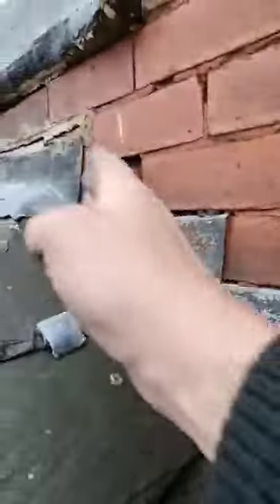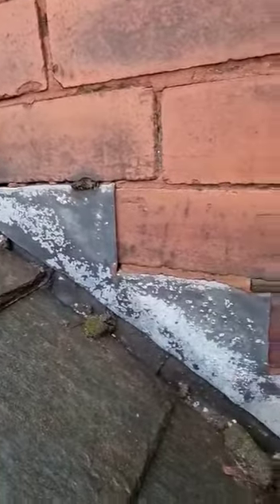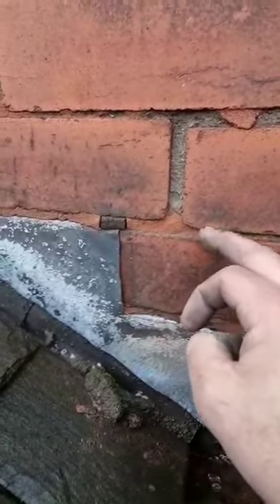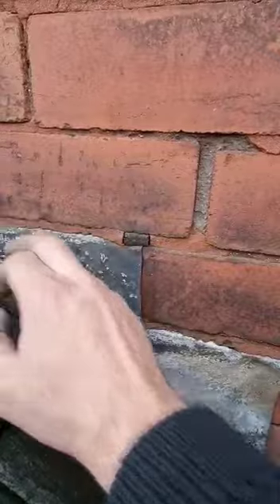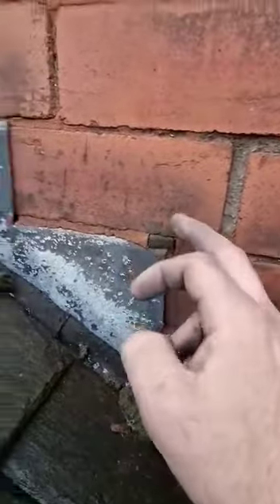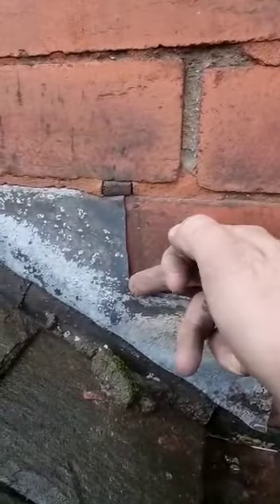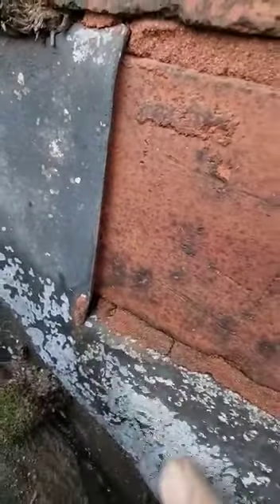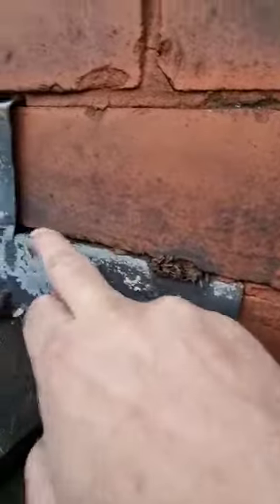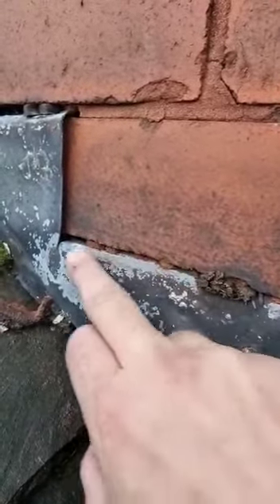The lead work here — this is what you call a cockney flashing, so as you can see it's an all-in-one flashing and the name is cockney flashing. Now what you do with this is you come across but then you have to come up at an angle and continue so that the water can't penetrate the area. The way they've done this, they've just done it straight, so this is your weak point here — there you go, you can see it. Weak point. See how that's coming away.